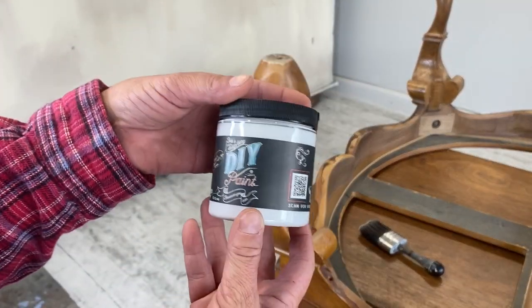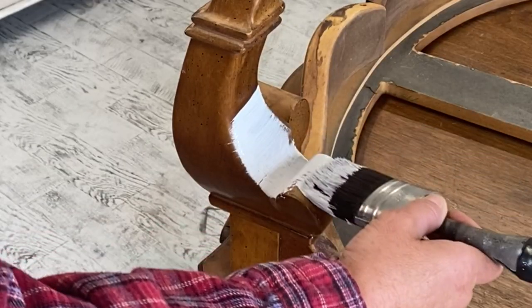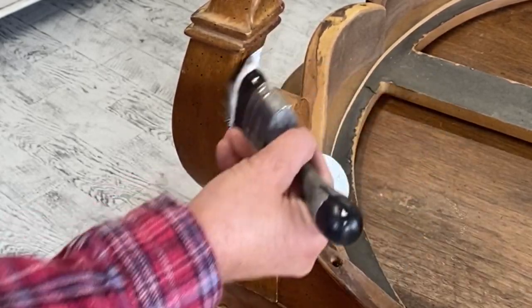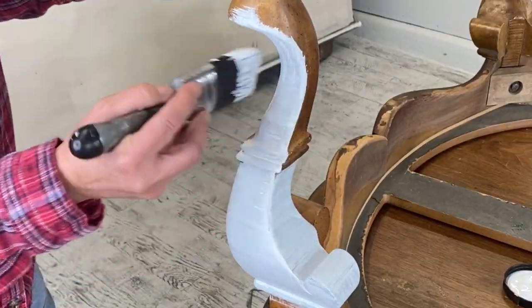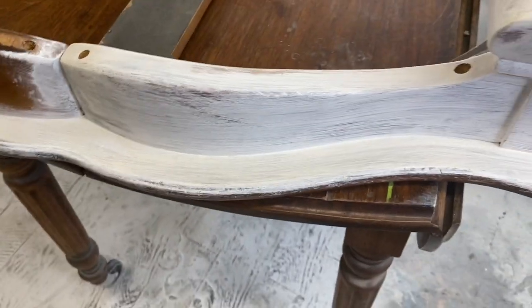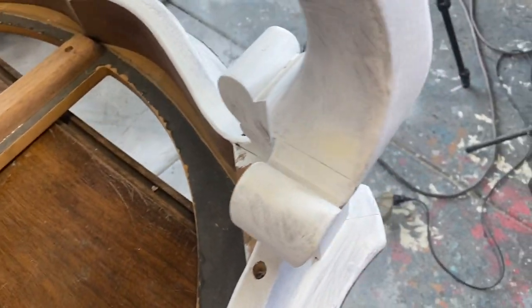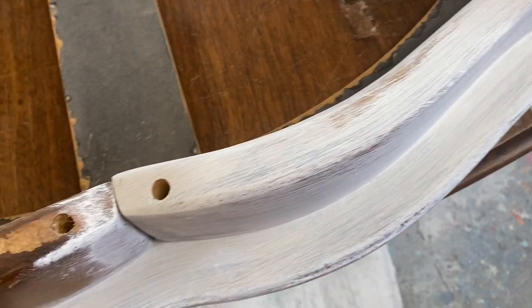Time to whip out the beadboard — this is a Great White by DIY. I'm going to go ahead and get going here. It's nice and thick, and it'll only take me two coats to cover all this, which is fantastic. I'm going to do a test — just do a section of this before we do the whole thing to make sure and check if we're going to have any bleed-through. I've learned over time doing numerous projects that it's always good to make sure. I don't like to use my primer unless I have to, so I always kind of do a check — and sure enough, can you see that? It's yellow right there. So this guy's going to bleed on me, so it's time to back up a step.